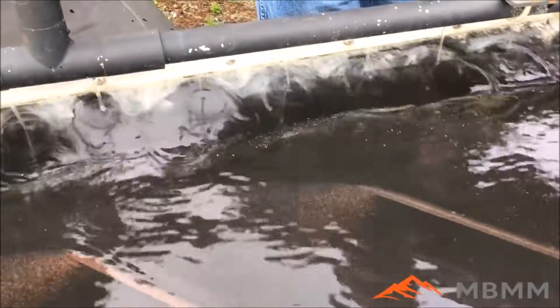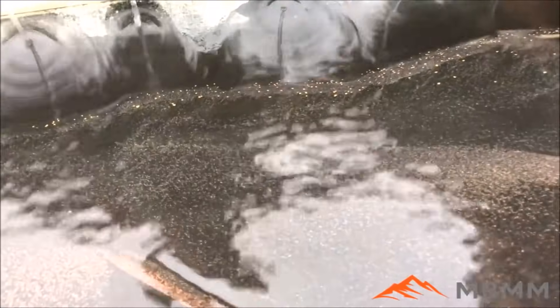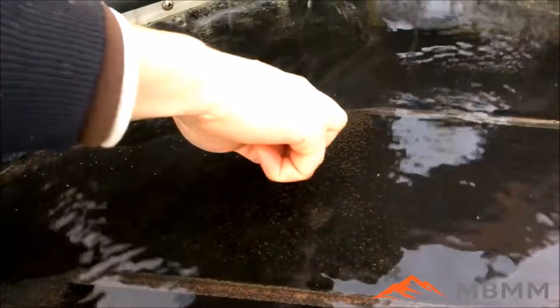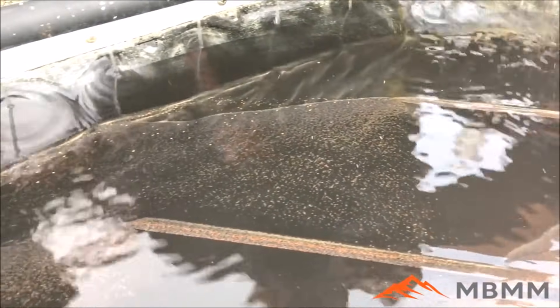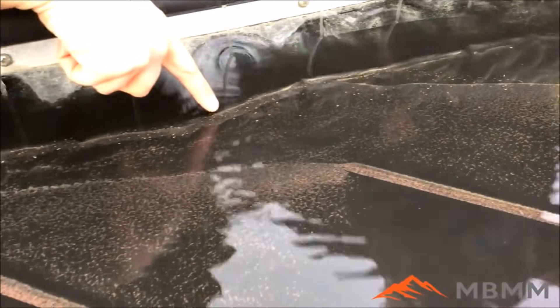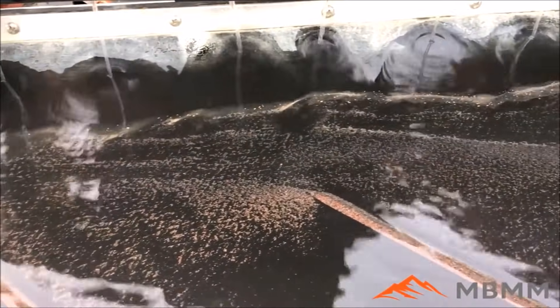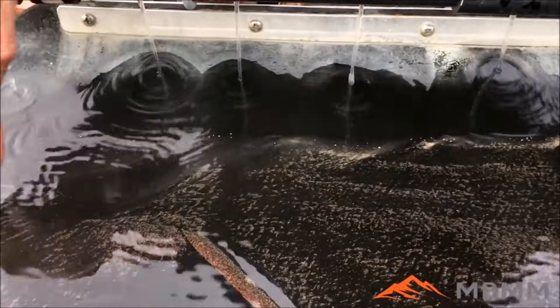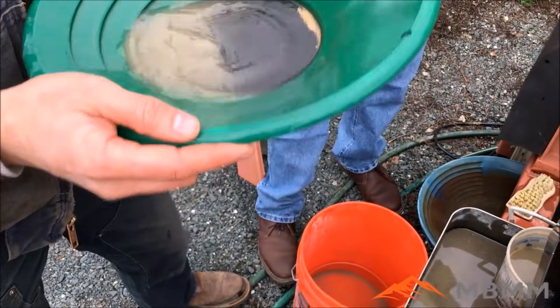Here's a really good shot — I'm going to unplug the table and leave the water on but stop the shaking so we can really see what's going on. All your gold is coming out of this first groove. As soon as it gets off this little sandbar of black sand, it's caught in the groove and going down this way. There's some other really heavy stuff — the black sand that might be where your PGMs are — coming down with the gold. But by the time it gets down here, it's pretty much all clean gold, with just a little bit of black sand carrying its way down into the number two.